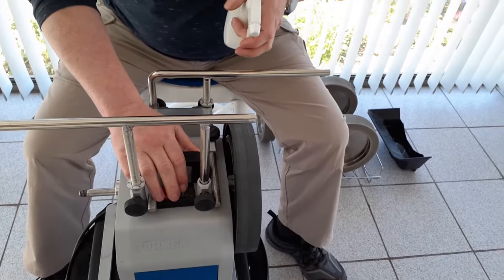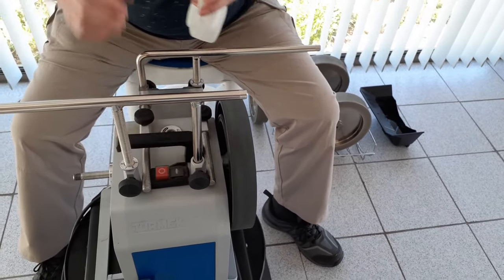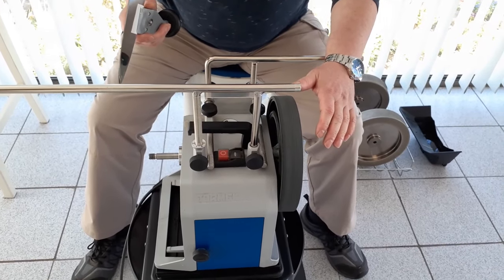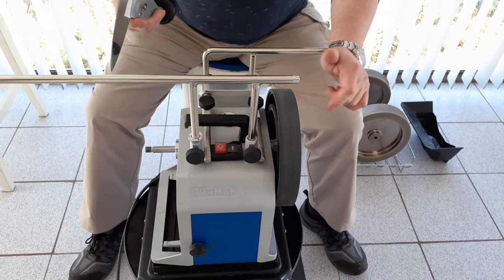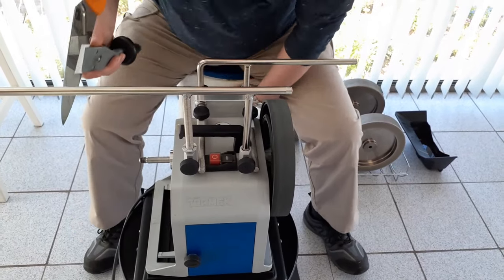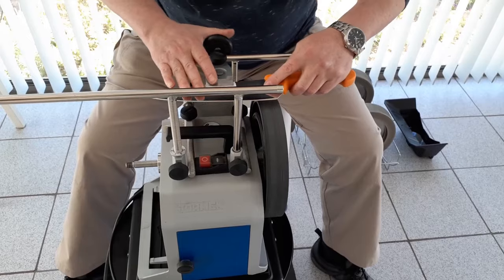Moisten the wheel, but go easy. Water should not be dripping off the composite wheel. As with the leather wheel, the rule is not to over-oil it. With the composite wheel, do not over-moisten. Alternate the sides of the blade with each pass.